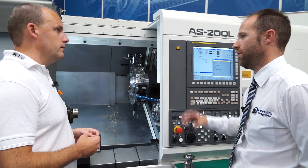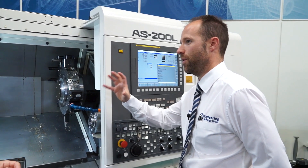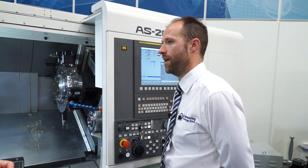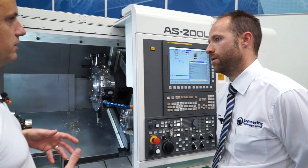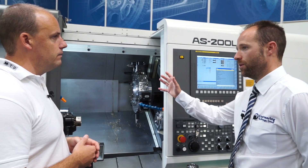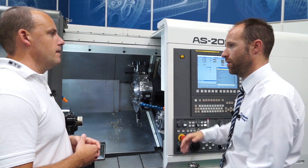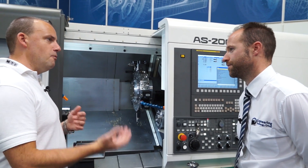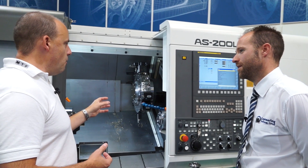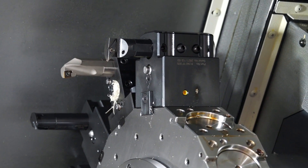15-station? Yes, it's quite unique. Nakamura, when developing a machine, they always look outside of the box and try and pinpoint some ideas that aren't out there. Does that mean you've got a bigger turret so you might compromise your turning diameter? Well, we do have a variant option — if we need a larger turning diameter, we can put the 12-station turret on, but we bring the product in as stock with a 15-station. Double-point indexing — do you have that on this turret? Not on this turret, that's on our twin spindle, twin turret range.